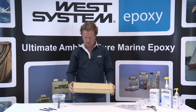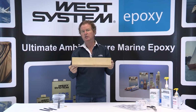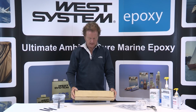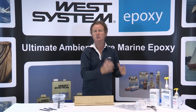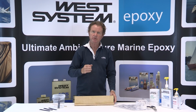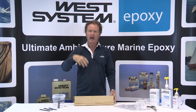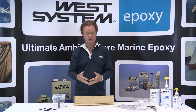What I'd like to do is illustrate on this small scrap of plywood how you go about doing that. Now, if you look at all of our other videos, you'll see that we mentioned two-step bonding as best practice. This also applies for fillets. Two-step bonding provides the most robust bond between the fillet and the plywood and consequently the two adjoining panels.